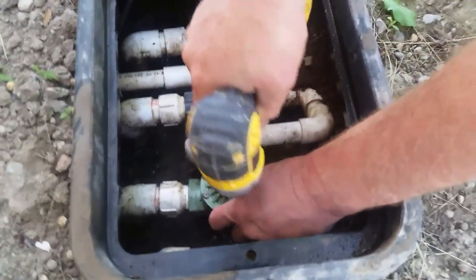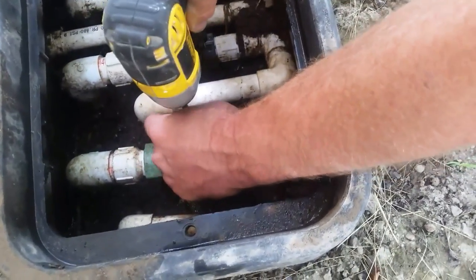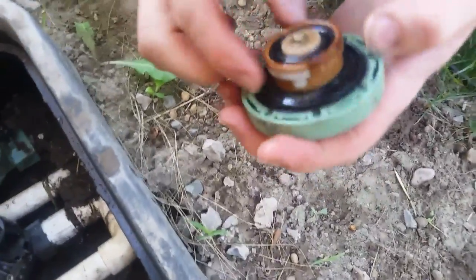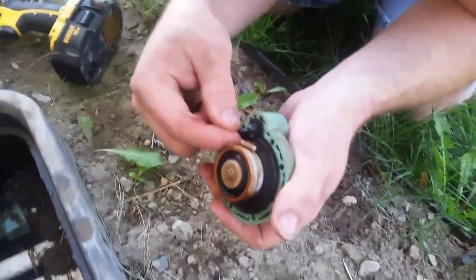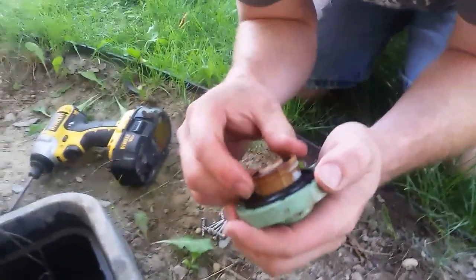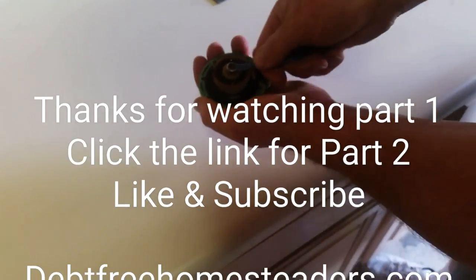Can you rebuild it while it's still in the box? I've had to end up replacing the whole thing anyway. This is the diaphragm I was talking about — sometimes you can just clean these up. This is what vacuums open and vacuums shut to completely turn your water off. I've never run into this particular design, so that's kind of interesting. We will go and pull this apart and clean it up. Break out your wrench set — you're going to need your six-millimeter for this. We're going to pull this little screw off.